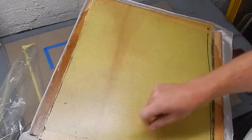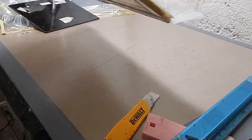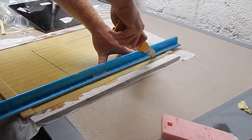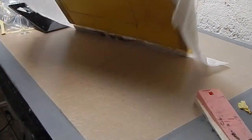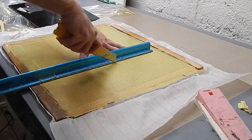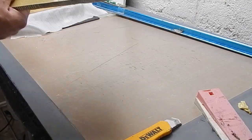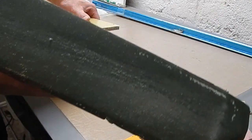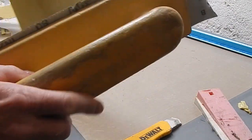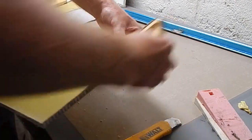You can see that discoloration there. Overall it feels pretty nice. Now we're coming to one of the really problematic bits with Kevlar — it's super hard to cut even when it's laminated. I didn't have a bandsaw, so I'm using a sharp razor knife with a fresh blade; I think I broke it off a couple of times to get a fresh edge. It really does a number on the edge, and this is a pretty sketchy way to do it. Fortunately I've got that safety ruler and no fingers were harmed. But if this were more than one ply, this wouldn't work very well. The edge came out a little nasty, and I started with coarse 60-grit sandpaper on the board — it really just turns to fuzz. Sanding Kevlar just doesn't cut very well; it turns to fuzz. One good way to make it less fuzzy is to use lighter and lighter sandpaper. Finishing off a Kevlar edge with 400-grit on a DA can get a really nice surface.